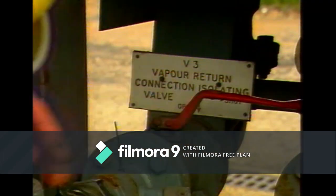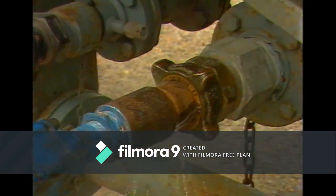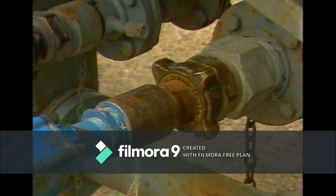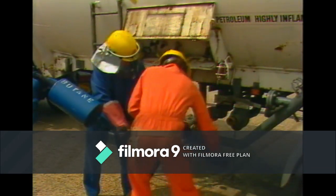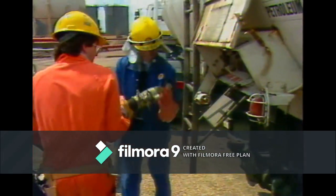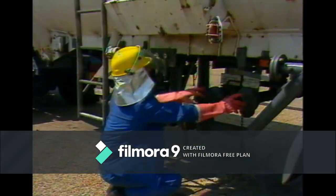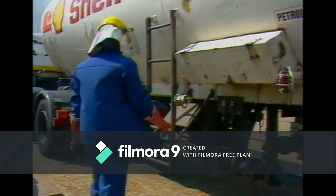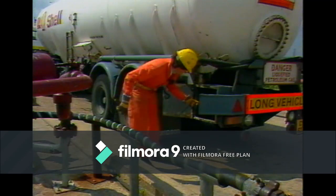After checking that it's safe to proceed, the liquid can now be allowed to bleed from the hoses by slightly loosening the couplings. In some areas, bleed valves may be fitted. When no more vapor appears, the hoses can be disconnected. Where depot staff do the loading, it's essential that the driver checks all the hoses have been uncoupled. Ensure that all valves on the vehicle are firmly closed and the couplings properly capped. Then reload the fire extinguishers, wheel chocks, bonding wire, and so on.